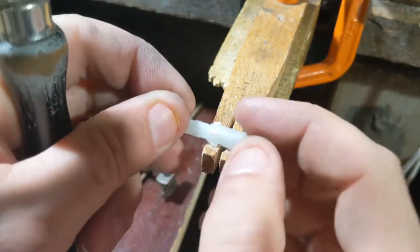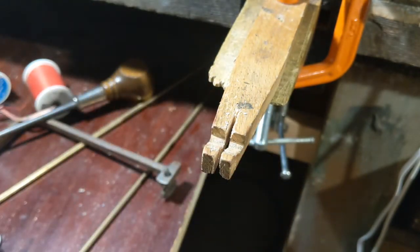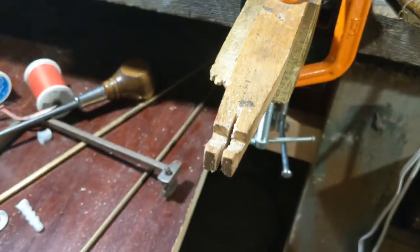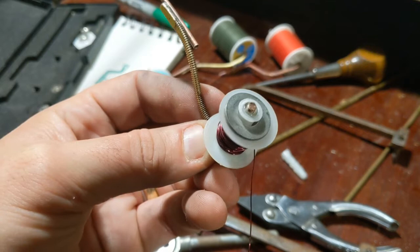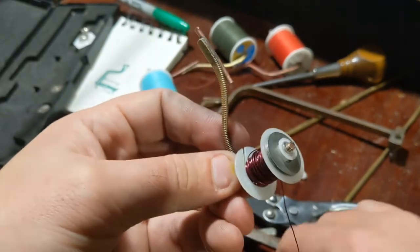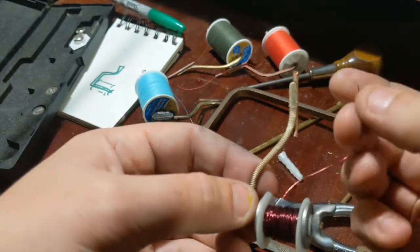I'll go back to my little jig and cut the anchor to length for the other one as well. I actually had to add a little piece of vinyl tubing around the axle of the bobbin to give it a little more bushing inside the drywall anchor. But it's nearly perfect now — it has a really smooth action. I'm going to go ahead and put the wing nut on, tension it up, and thread it.